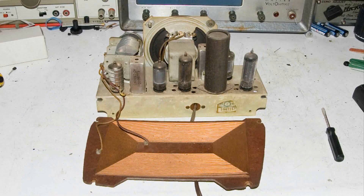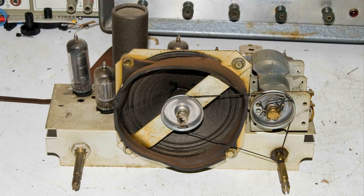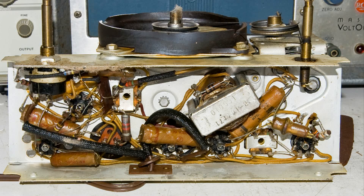Here's a closer look at the insides before I pull the chassis out. And here the chassis is out, and you can see the dirt a little bit better here. This is the front, and this is the underneath, and you can see that those wax capacitors have gotten warm — got bubbles on some of them, or most of them. So they're going to be replaced, and of course the electrolytic will be replaced also.